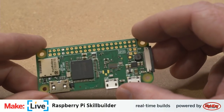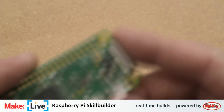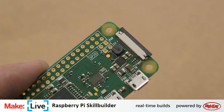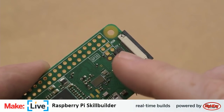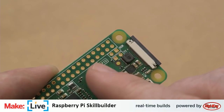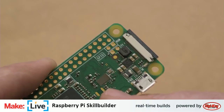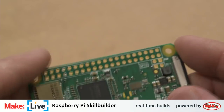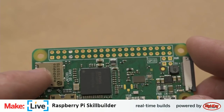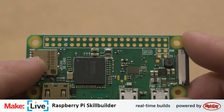And the other cool thing is that you can still use an analog display. I believe so. Yes. Get a closer look and get real in there. You can still wire up your own RCA cable and analog. I think this top pin is for analog audio as well. So you can still do your analog audio and video out if you want to. And while it doesn't have the header pins, it has these rows for them. So you can go ahead and solder on your own header pins, but if you don't need them, you can keep it nice and slim.